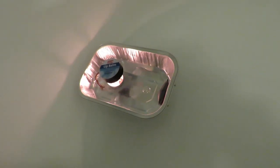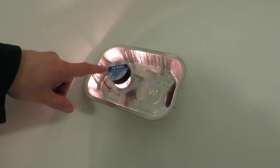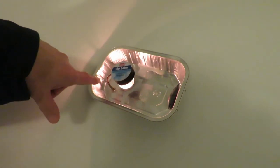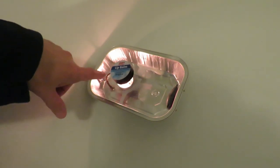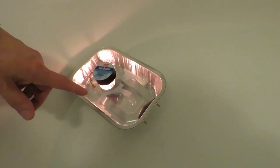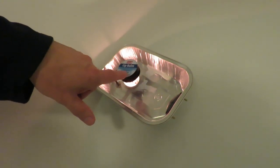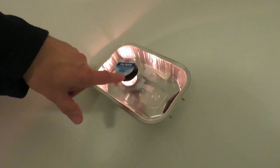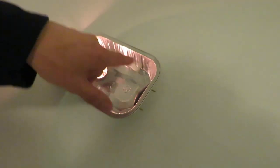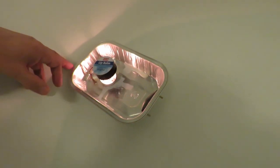Well, battery just went when I was doing my final summary, so I'll just do it again. So we've got a lip balm container that I've soldered shut, a couple of brass tubes that I curved, so they go in the front, round and stick out the back. We're using a tea light that's got 4 wicks in it to give us extra heat. And I also had to tip most of the water out that I'd put in there because it just couldn't heat up the volume of water to get the right effect. There's a bit of weight in the back of this aluminium tray just to make sure the pipes stay in the water, because they need to be in the water for it to work.